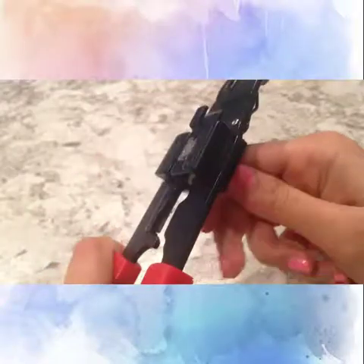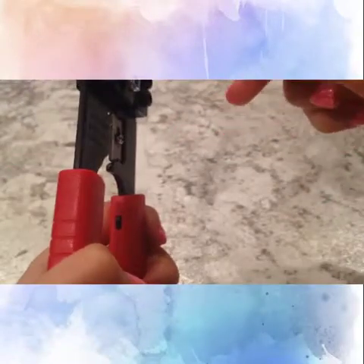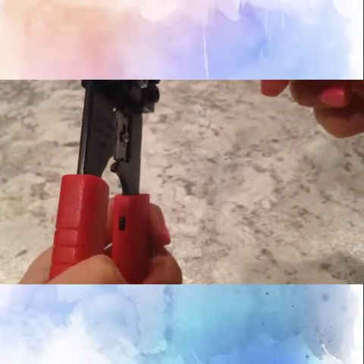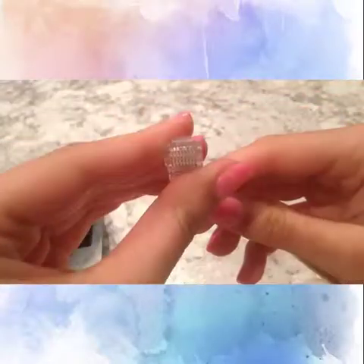Once I have all those evenly laid out, I will start straightening up the wires and making sure that they're all even, cutting them as I did before. Once I insert it, I'll make sure that the ends are hitting the metal piece at the end of the plastic part, and I will crimp it once more. And then you're done! You can start using your Ethernet cables immediately — plug it into your computer and into your router, or into anything you're going to use it for. Thank you for watching and please stay tuned for any new videos.